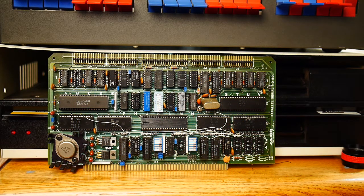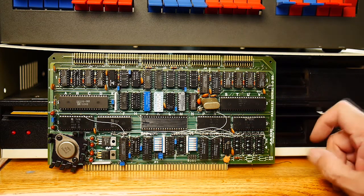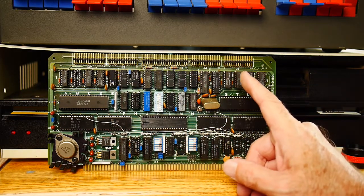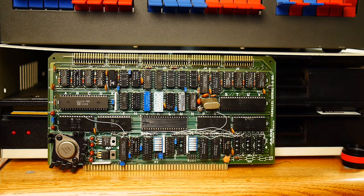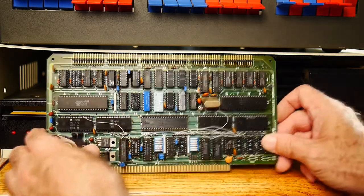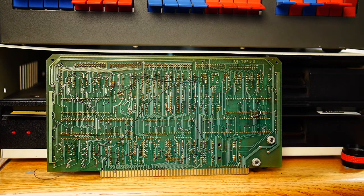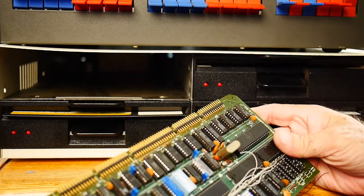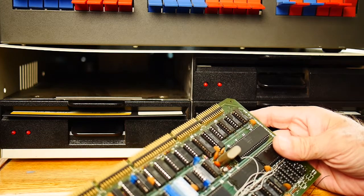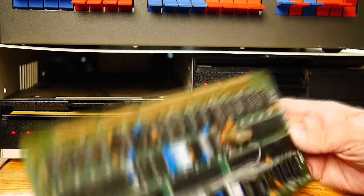Here's a complicated board. This is a Jade Computer Products board — pretty famous — a Parallel Serial I/O board. J12345. It's got one big one and four little ones. It took a lot of power, I guess. It's got some bodge wires on the back. It's pretty common for boards of this vintage to have some bodge wires on the back, especially a board this complicated. It would cost a lot of time and energy to redo it. There's a bunch of Zilog parts on it. If I had to guess, I'd say it was four serial ports and one parallel port. I don't see a date on it.